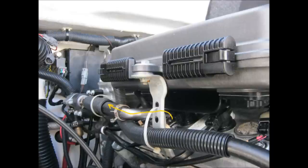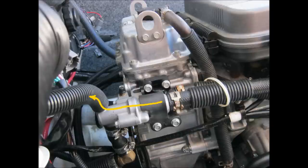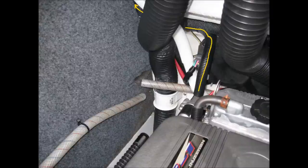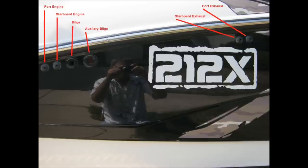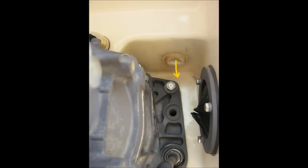After cooling the engine, the water flows out the top and through a hose to the thermostat located next to the oil cooler. From here it flows two ways. Like the exhaust cooling indicator, Yamaha has provided a means of knowing you have water flowing through the engine — a hose carries this heated water to a through-hull fitting as seen on the left-hand side of this picture. The majority of the engine cooling water flows down through a hose through the bulkhead and eventually out a through-hull fitting on the stern.